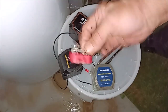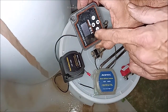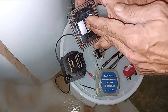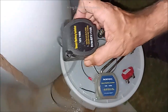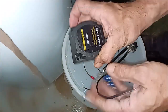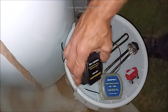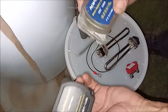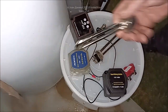These terminals are what we're going to use. This is an adjustable VSR. If you have a different type of system — like lithium-ion — you can get these in 12 and 24 volt. I'll put links to these too. This one here is a cheap one — works the same but doesn't have a light. It will work for the same purpose using the thermostats that are already in there. You want to use the upper thermostat as your trigger wire for this, or you can put one for each element, which is a common way of doing it.